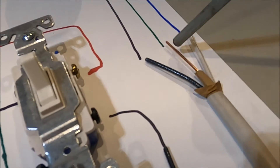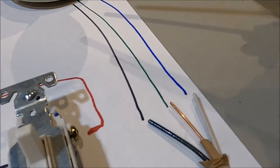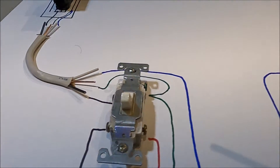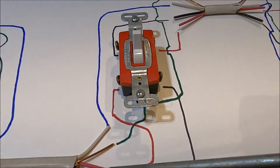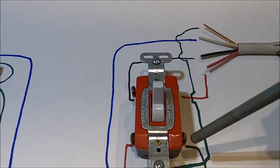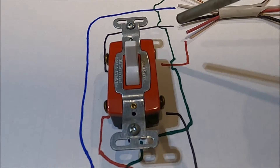The ground wire — I showed it as green because sometimes you'll see them as green wires as well, and those were the colors of markers I had. If you've watched the other videos you've seen how these are connected up. What you really want to focus on in this video is how the power is being directed through the switches. Make sure the wires from one end of the circuit go to the two screws on the bottom, and the wires from the other part go to the top — don't get them switched. Think of it as an X: power comes in, the switch sends it to either other screw, and if you get them wrong the circuit will either always be on or always be off.